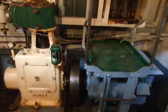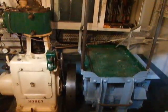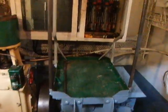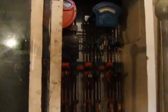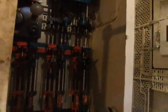We've got the main generator engine here — again a 110 volt DC system all on board, and originally would have been powered by this steam power generator when the ship's in steam. You've then got the switchboard up at the top here. Unfortunately the glass doesn't help the filming but you can see the gauges and all knife switches — DC, so they're all spring loaded so that they disengage quickly to minimise spark.